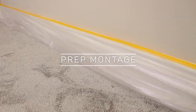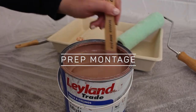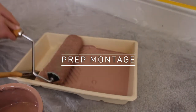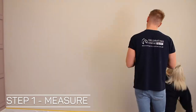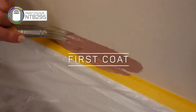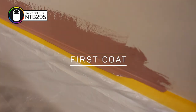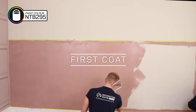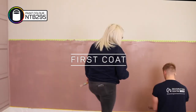The cover mask is just to protect the surface, and always make sure that you give your paint a good stir before pouring out into your roller tray. Measure your wall and then mark points along the wall to help create a straight line. Then get your first coat on — start by cutting in the edges first and then filling the centre with the roller.